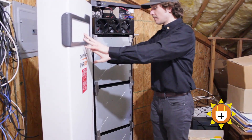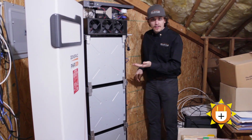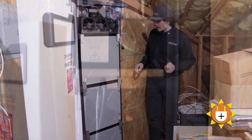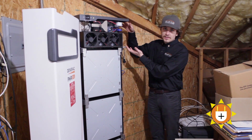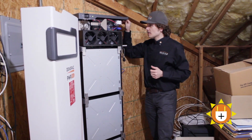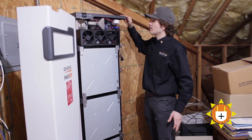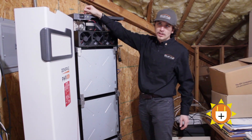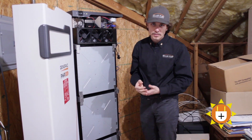Super easy disassembly. Here we have the battery units themselves — there's six of them. You can only see three, but they're stacked double. They're all in series, so they're all one big unit. They come in here to the transfer switch and charge controller, and the voltage gets stepped down to 480 and gets sent to the inverter so that it is DC coupled with the solar.